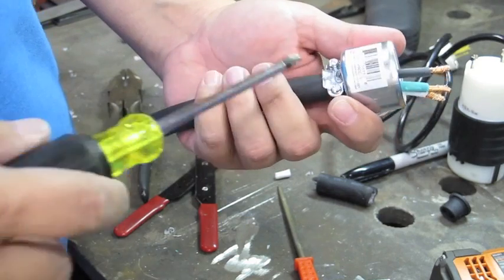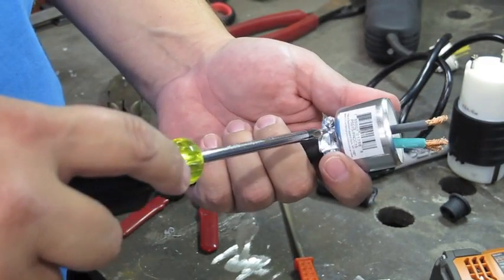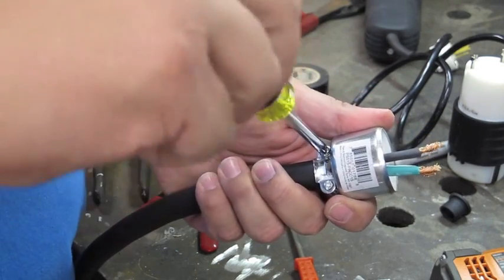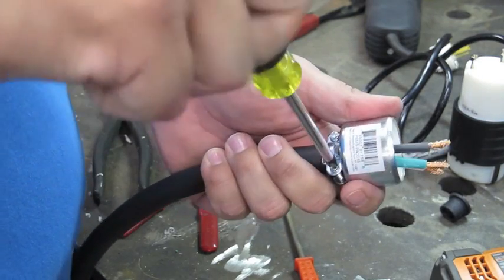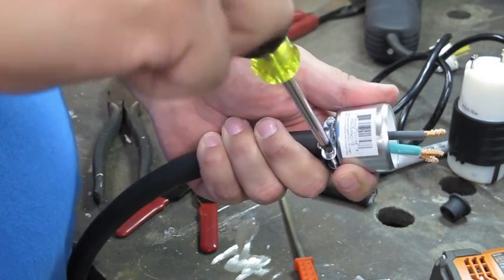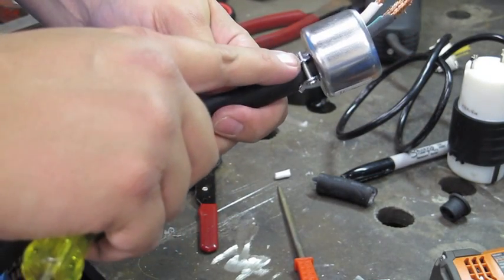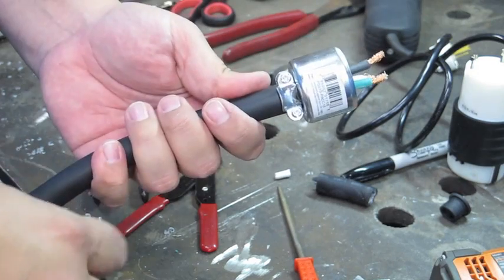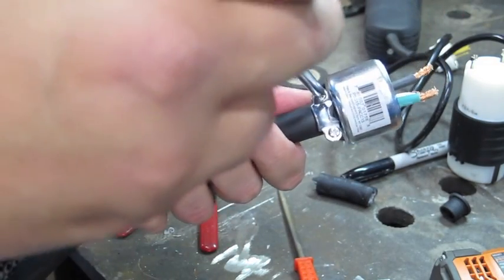My solution ended up being I went ahead and cut off that tab with a little cutting disc, then deburred it thoroughly using a file, making sure it's very, very smooth. We don't want any areas where the sheathing or wire can be cut. One of these tabs has threads in it and the other is just a straight-through hole — obviously make sure the one that hooks into the piece is the one with the threads, that way everything will be held in place.